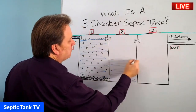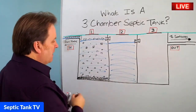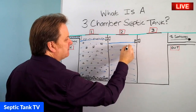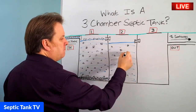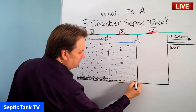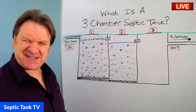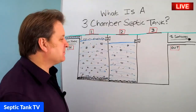The second chamber also fills up with water to its own tide mark. Because much of the debris is kept and held in the first chamber, some suspended solids will still come through from the first chamber into the second chamber, but there will be a lot less of them. The particles will be smaller, and a lot of the debris will settle and fall to the bottom of the septic tank. You can start to see how these two- and three-chamber septic tanks work — they're basically like a filtration system that filters out particles and cleans the water.